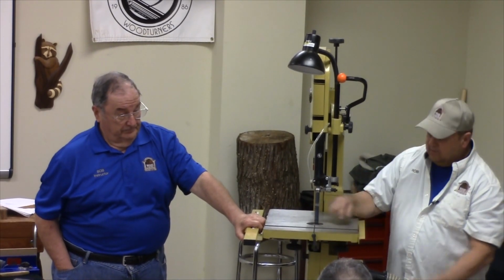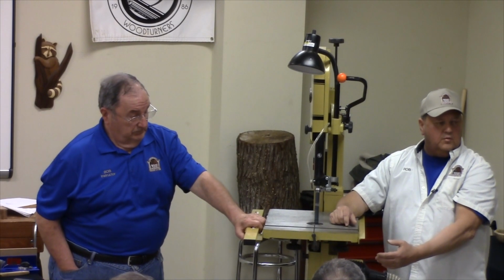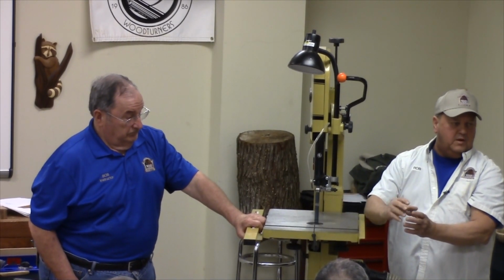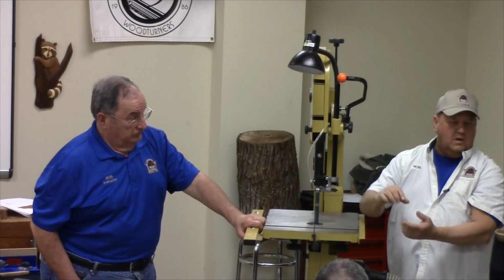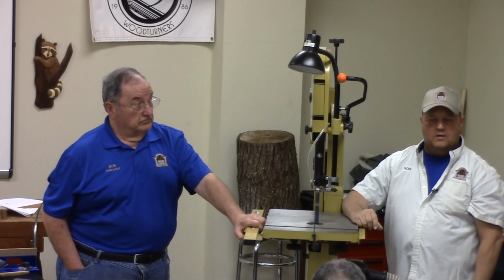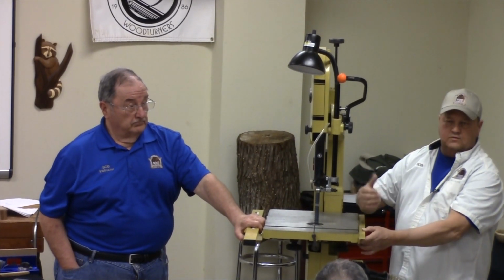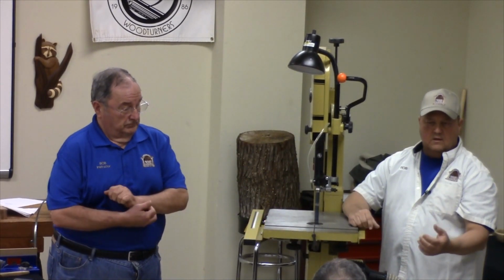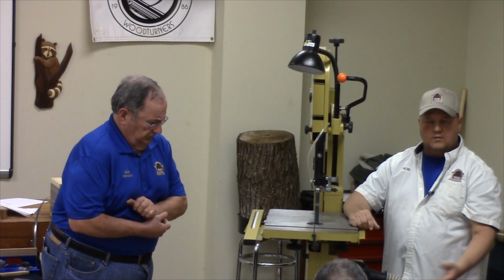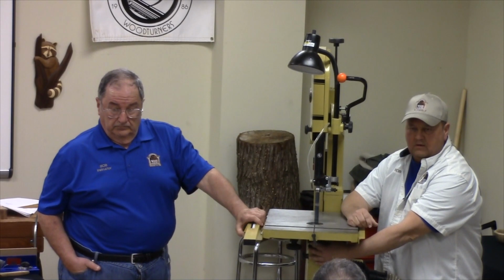Well, the one on the Delta, it's dropping down through here, and this thing where it's going on to is a couple inches in front of the blade, but it's about this far down from the table. So whatever's coming down has some suction there, and it'll drop down. I hooked mine to one of the silent vacuum cleaners like we have back there, the quiet ones. That's what I use with it. I have it hooked up so when I turn on the saw, that comes on at the same time. It does a pretty good job of collecting stuff, but all it's collecting is the stuff that falls down here.